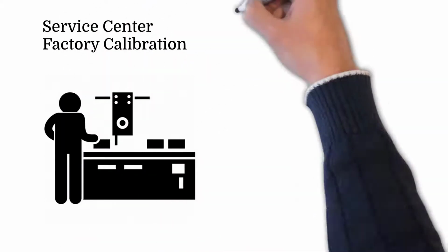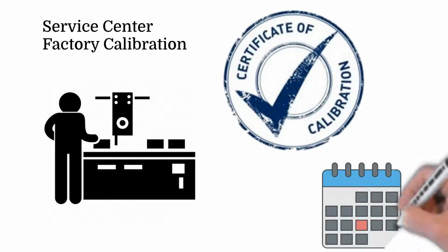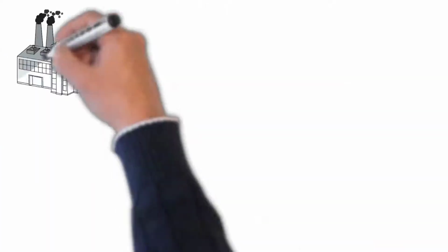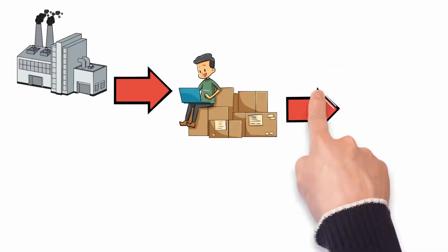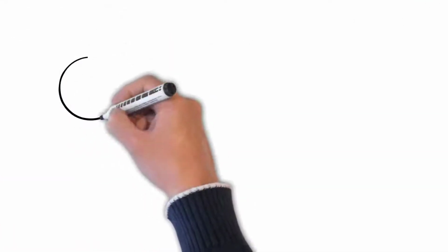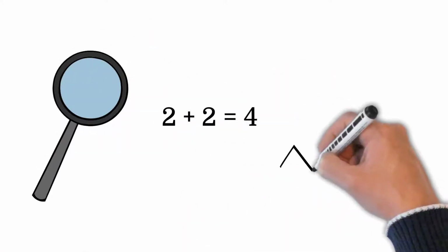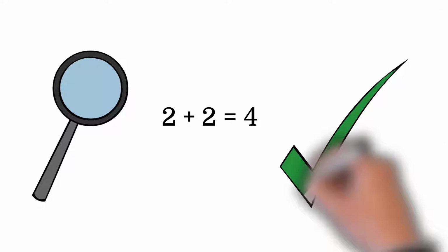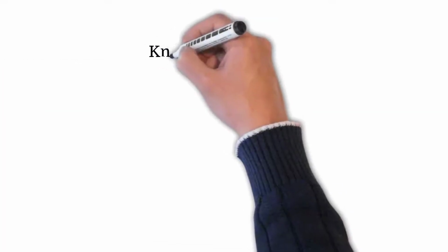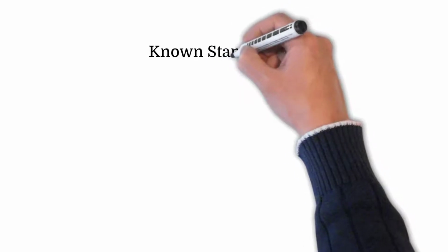It's not enough to say your scanner has been factory calibrated. Calibration only confirms that your scanner was working as designed on the day it was serviced and calibrated. Shipping from the service center and day-to-day handling of your equipment could potentially affect the accuracy of the scanner's measurements. With this in mind, you should independently check your scan data on a case-by-case basis by using a simple point-to-point mathematical procedure. Using a known measurement standard within your scan is an excellent way to check the scan data accuracy.